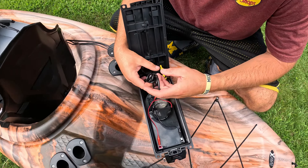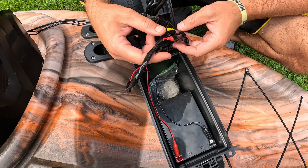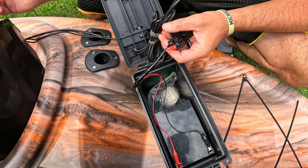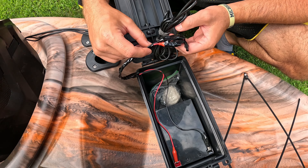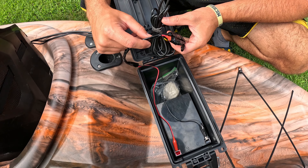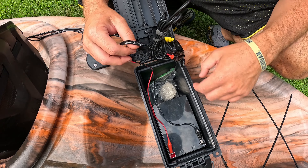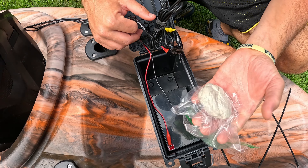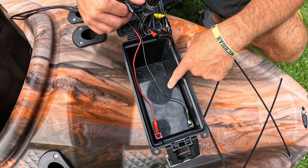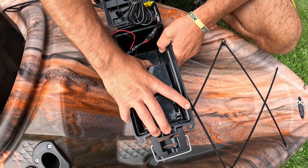Inside the box I have the battery — it sits snug in there. I have electric-taped the alligator clips to the little parts that link to the fish finder to power it. It looks like it's set up to attach to a trolling motor, but obviously I don't have one of those in the kayak, so I just rigged it up like this and it works great. I did get some heavy-duty stick putty and layered the bottom of it so my battery stays in place. I can pull it right out very easily if I want to.